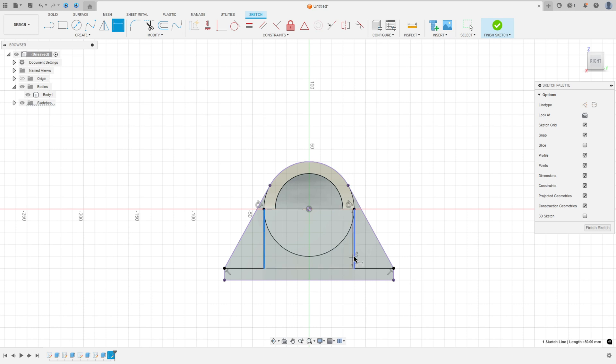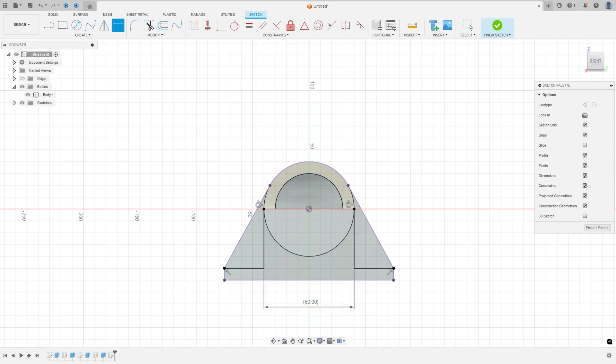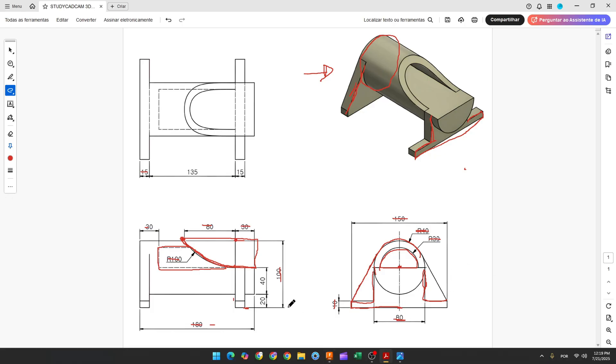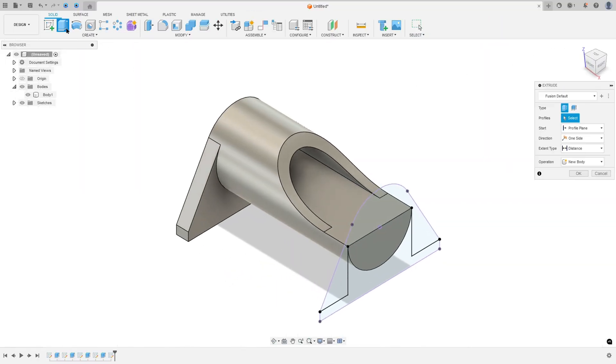And the distance between the two lines is 8mm. Now we need to extrude this 15mm — the thickness of this base. We know that the distance between this face and this face is 30mm, so the distance between this face and this one is 15mm. We will make an offset extrude. Finish the sketch. Go to Extrude.